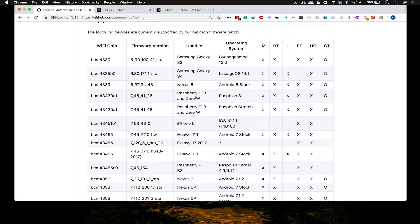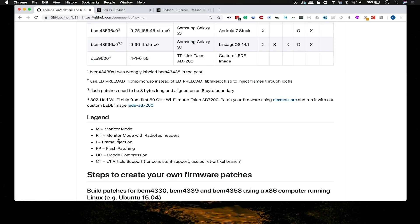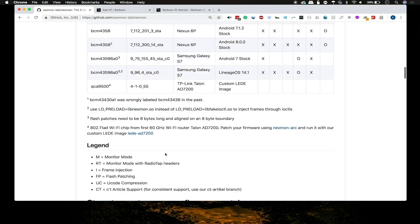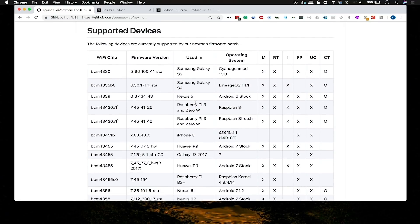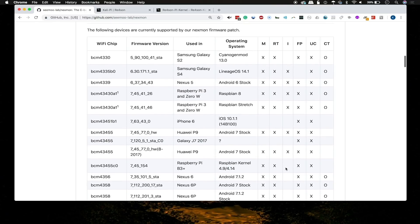You can see the Raspberry Pi Zero and Pi Zero W are supported, including packet injection, frame injection, monitor mode, monitor mode with radiotap headers, and all this other great interesting stuff — all included on the Pi Zero W as well as the Raspberry Pi 3. For the Raspberry Pi 3 B+, it's a slightly different story: we get everything except injection. So for Wi-Fi hacking purposes, it's actually better to use a Pi Zero W or a Pi 3 rather than the newer Pi 3 B+. Keep that in mind when making your selection.